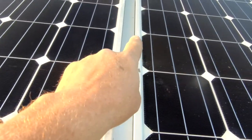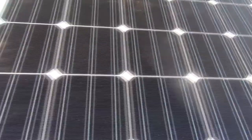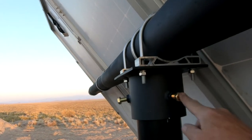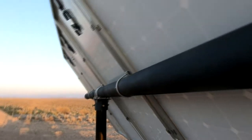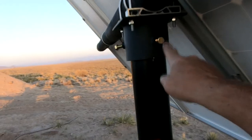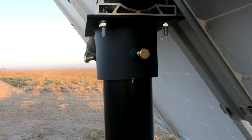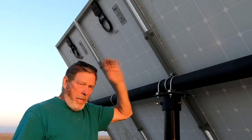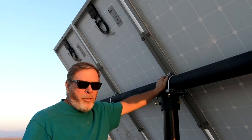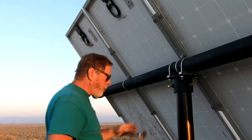My spacing measurement was pretty good but I have a little bit of a gap on both sides, so I'll wiggle the panels to get them to fit right. I'm sure the instructions must be incorrect on the torque spec, as I expected with these bolts. Now that everything's on there, I can grab these panels and see the movement — that's all in the bracket down there that connects to the pipe. I'll look up the torque specs for this size grade-8 bolt. It looks like a 7/16 — I'll torque it to those proper specs, because 24 pounds is way too little.